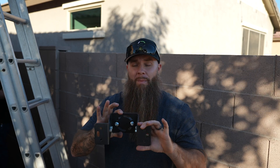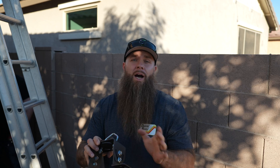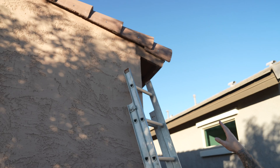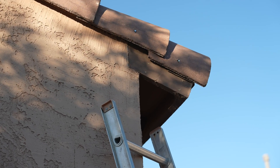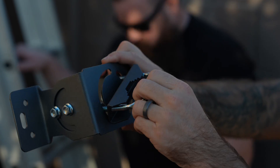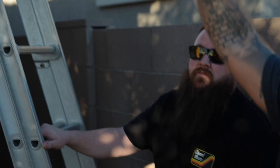Now that we're beginning the installation of the antenna above the roof, it's really important to identify a firm foundation to put that mount on. When identifying a firm source to mount this on, it doesn't have to be perfect, because the mount is adjustable in three different ways that will compensate for different angles. Here we're using the awning of the roof just below the tile — it's at an angle — but this allows us to adjust one way and also pivot the mount the other way, which compensates for the angle of the roof.